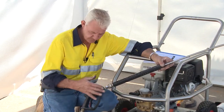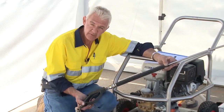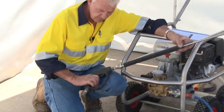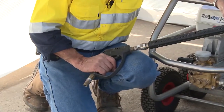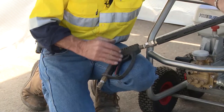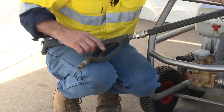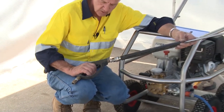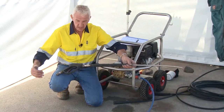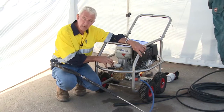One aspect that will undermine the integrity of any water cleaning unit and deem it unsafe is an act called triggering — repeatedly depressing and releasing the trigger. Once you start water blasting, depress the trigger and maintain depression to do the job. For every action at the gun, there's a reaction at the pump. Every time you let the trigger go, the pressure built up in the line has to go somewhere.